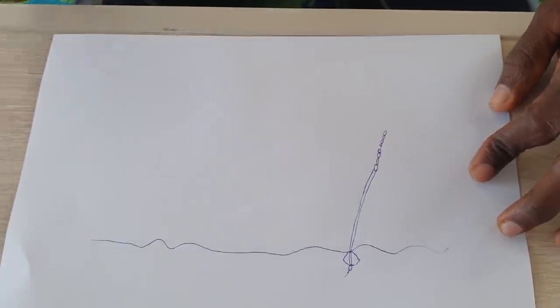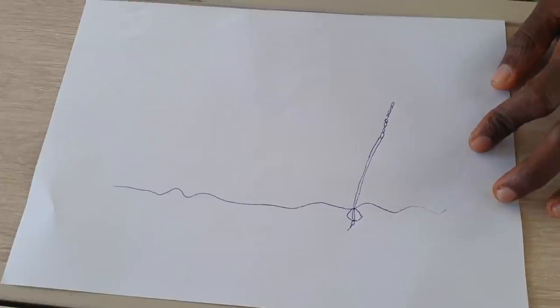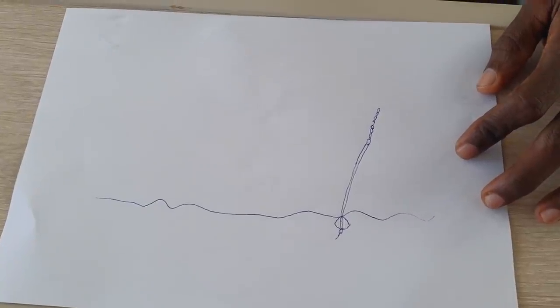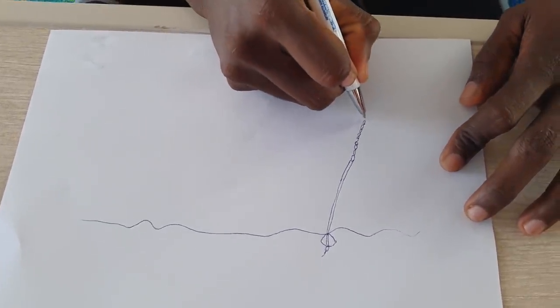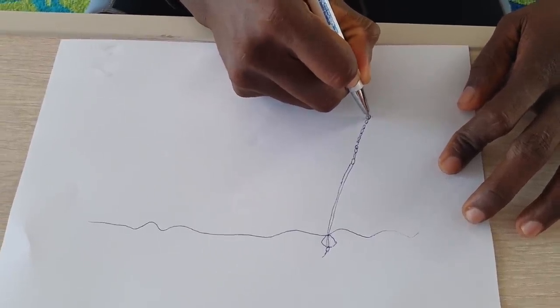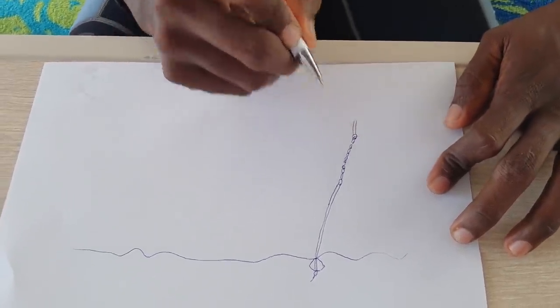So the chain, roughly, it's between 15 to 25 feet. And it's, as I said, 16 mil chain. So it's heavy duty chain. But these ones are not 16 mil. These are 14 mil chains, which we use two lengths of 14 mil chains because they're two different sand screws. So it's connected to one sand screw here. You connect it with a shackle, a big shackle, and the sand screw, they're very huge. I'll send her a picture of it later on.